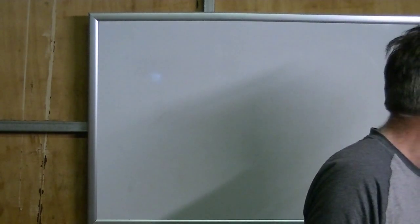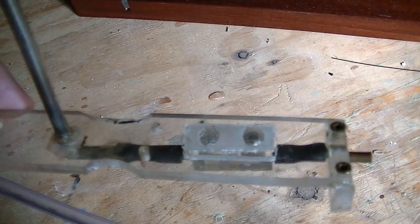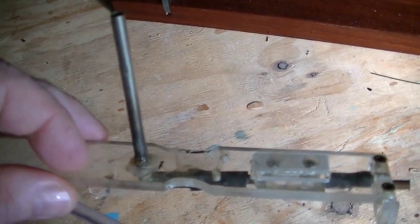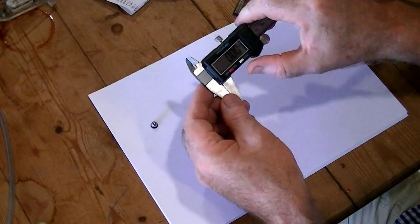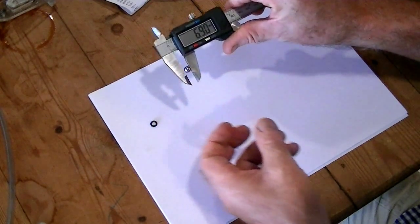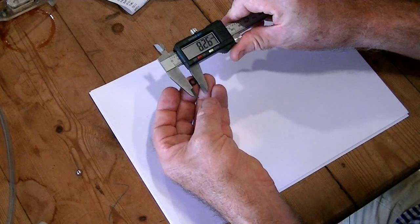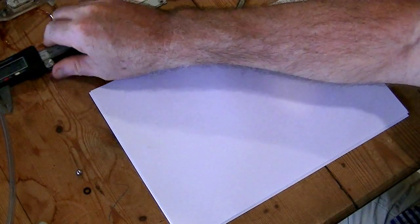Let me just explain. Here's a close-up of the valve — I do have this valve originally placed high in the boat, which was a mistake, but you can see it here anyway. To start, you need a couple of stainless steel ball bearings. These are 7mm ball bearings, and it's just an appropriate size — a 7 or 8mm O-ring so it can sit at the bottom and cause it to work as a valve.